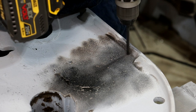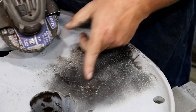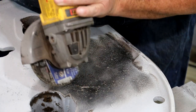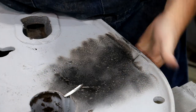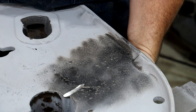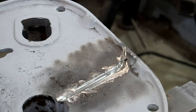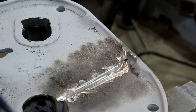What I want to do is grind but not go all the way through — I want to get down close to all the way through, but not quite, because we want to leave some of that original surface on the other side. I like the looks of that. I think we've got a good area in there that we can braze into. Once we get this bottom done, we'll flip it over and work on the other side as well.